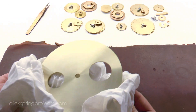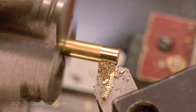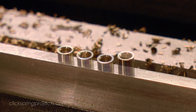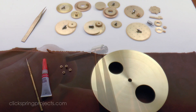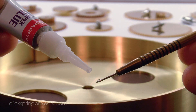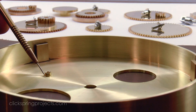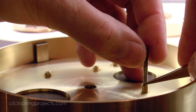So with the bowl complete for the moment, the next parts to consider are the bearings for the assembly pivots. The evidence in the original artifact suggests precedent for a simple collar bearing — basically a short tube soft soldered to one of the inside surfaces of the mechanism. On first glance this appears to be a fairly crude way to do things; it certainly carries a higher friction penalty than a modern watch or clock pivot, and it also permits a higher degree of lateral movement. Yet it turns out to be quite acceptable on both counts. The simplicity of the collar bearings brings a particular advantage to the build process, because they can be temporarily fixed into place with superglue, allowing a full assessment of the depthing and clearances without having to commit to anything permanent. It permits an opportunity for some low risk verification — it's all reversible, and it can all be cleaned up with acetone and pulled apart again once the testing is complete.